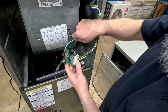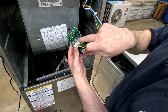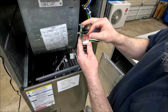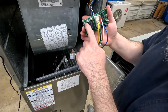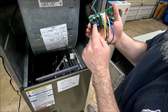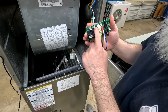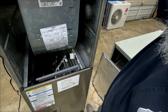My low-voltage wires: the white was on four — they call it J4 on the board — and the blue goes on two, which is J2 on the board. That covers pretty much the X13 connections. The only thing remaining is connecting the PSC motor: you put your chosen speed wire on the speed tap and the other side of power on the common terminal, then you could easily secure everything up in the top.